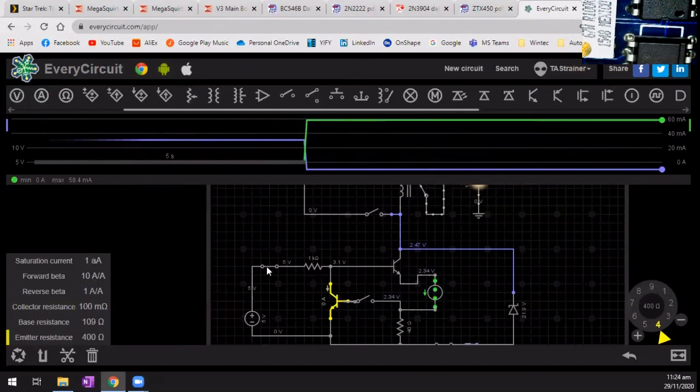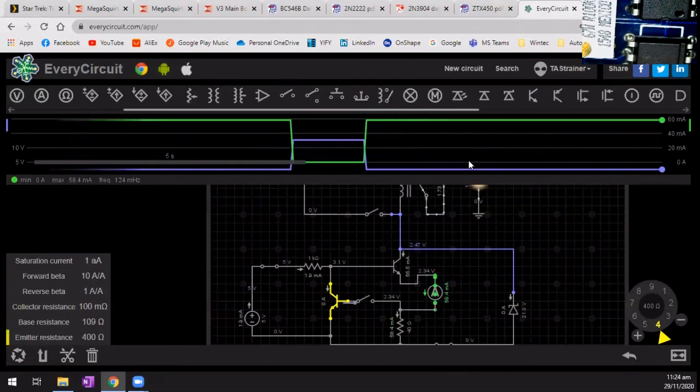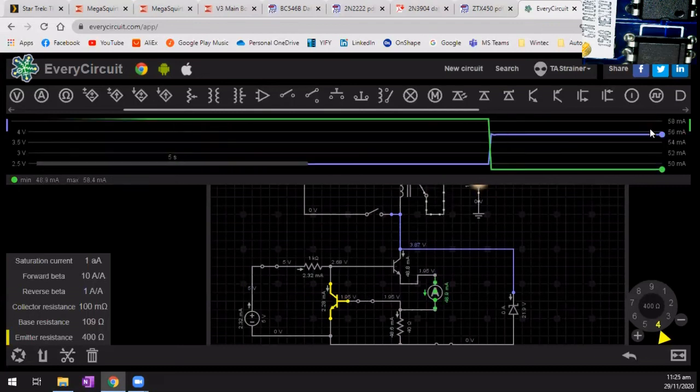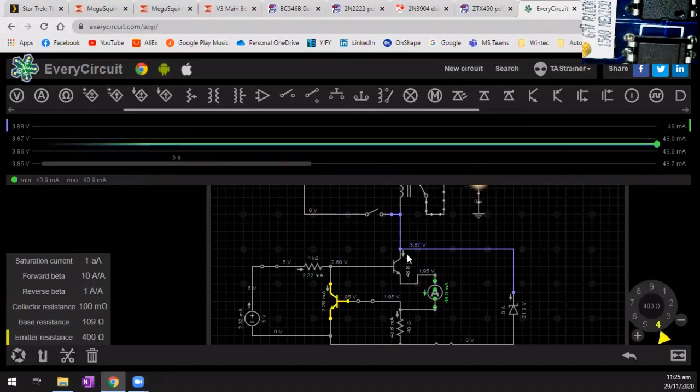Now if we put that on there, it gets rid of the back EMF. I'm quite far away, so we're probably not seeing that. But the green line sits at 60 milliamps, and if I enable this transistor there, it just drops it down a little bit to just under 50 milliamps. So this transistor is purely there for current control through that transistor there. So we could potentially remove that if we put another transistor in there to have that circuit work. I'm not sure I want to do that. So maybe what will need to happen is I'll have to order new transistors, and then replace them and go from there.